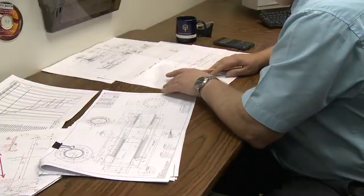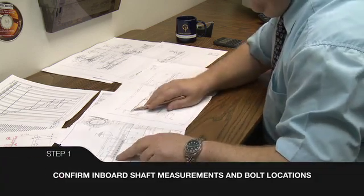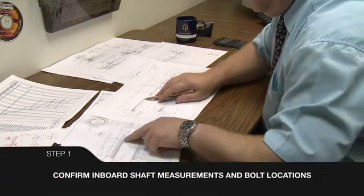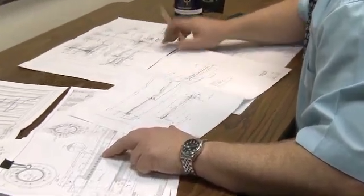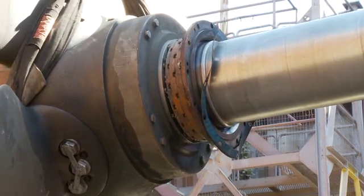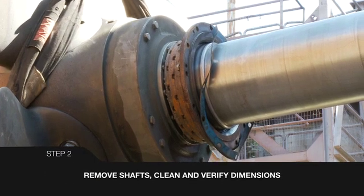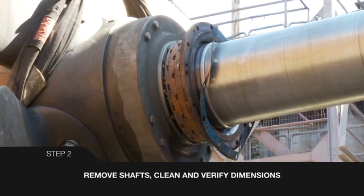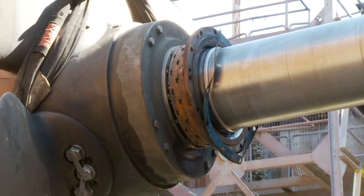The first task is to perform accurate inboard measurements of the shaft and bolting locations, especially the distance between the bulkhead flange face and the end of each tail shaft. After breaking the couplings between intermediate and tail shafts, the aft seal housings are dismounted and the shafts drawn aft. The shafts should be cleaned and prepared for liners.